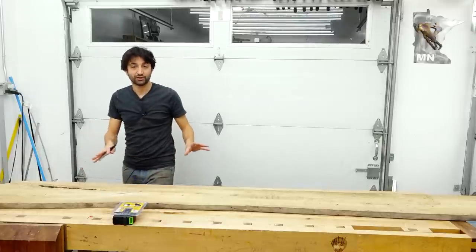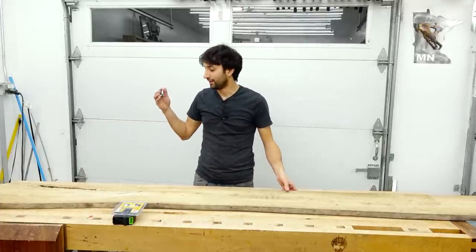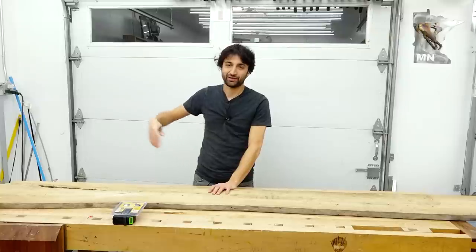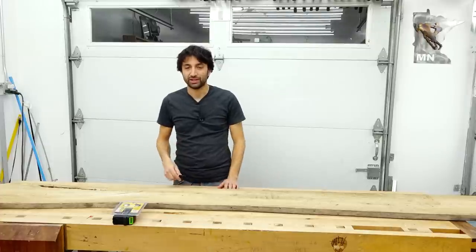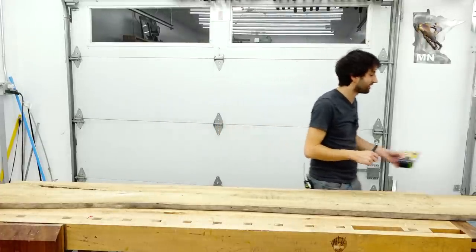You have a couple options with the epoxy fills. You can do them now or you can do them later. The one nice thing about doing it now is that once you mill this thing and get it surfaced, the epoxy is all milled off and surfaced exactly flush and flat. It just saves you the hassle of trying to apply epoxy to a surfaced piece already.